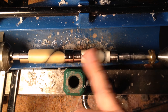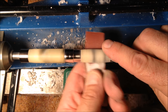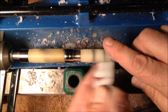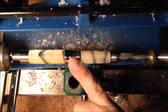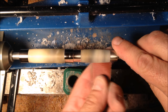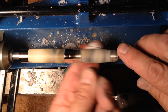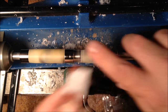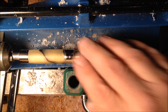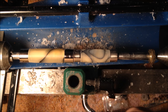Yeah, they really show up a little better as I sand because the dust is getting into the little nicks. They are getting lighter. Let's get a clean piece. I actually backed up to my 320. We're going to do a little bit of sanding with 320 and then hit it with 400. They are deeper than I thought. I'm going to go ahead and micro mesh this, and then I'm going to come back and fill these little nicks with CA glue.